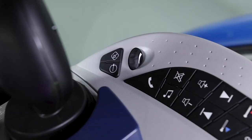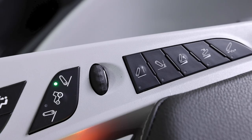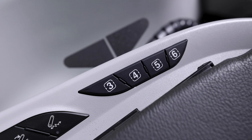The right side of the armrest includes easy access to 2 buttons and a scroll wheel to navigate through the display. So you can control the IntelliView via touch or through the buttons and scroll wheel, a feature especially convenient when traveling over rough ground. Conveniently located on the armrest is the multimedia area, which controls answering your phone, radio settings, temperature settings, fan speeds, and airflow settings. Dedicated functions for front and rear linkage controls and 4 additional configurable buttons can be found here.